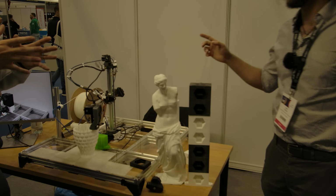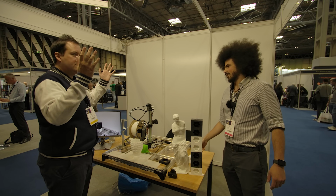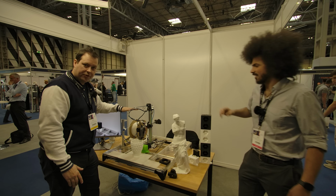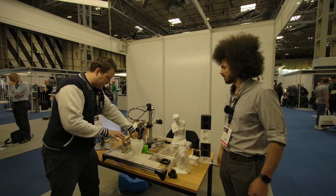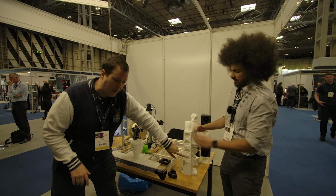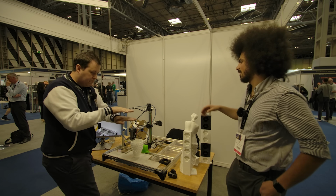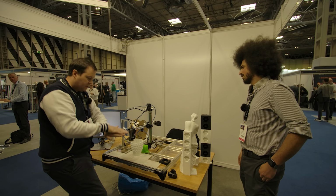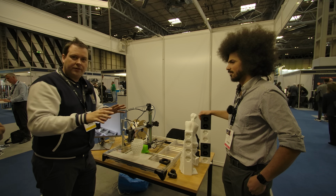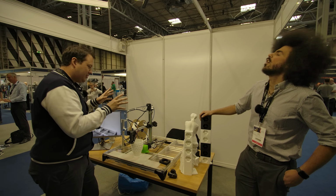But we're effectively talking about, in this particular configuration at this stage, infinite Z, where the robot has a finite Z inside of the lead screw. As the project continues to print, it prints more of these boxes on the back of whatever it's printing, and it is continuously moving up the Z-axis by moving in and up and in and up. It is continuously moving itself up the back of the print as well. So in this configuration, you've effectively got an infinite Z. But to be clear, that's not the limitation, not the end goal, right? This is just stage 1.